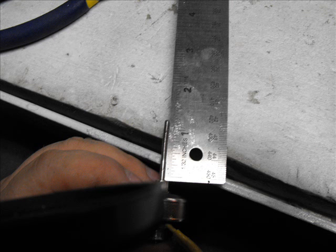What you're looking at here is me taking a look at the shaft after I straightened it with the pliers before I took it out in the garage. Once I took it out in the garage, I didn't have the lighting to take photographs. But basically the process is I have a couple flat plates I can put in my vise to keep it from messing up the shaft, and putting the shaft in and just squeezing it straight gently. If I have some other little bends, I might take the needle nose pliers, heat the shaft up and give it a little attention with the pliers.